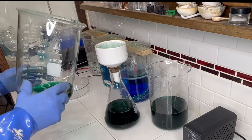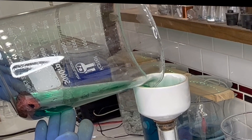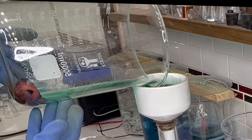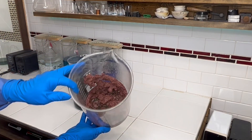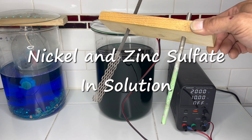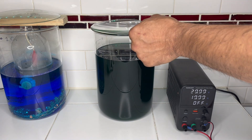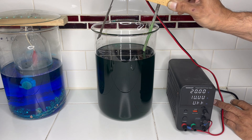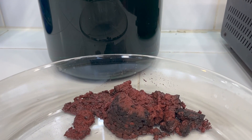I've tested this copper in the XRF and it's basically three-nines fine as long as you rinse it very well. The lowest I've seen it be is 99.5% based on what material you run in the copper cell. For this experiment we're cleaning out number two copper cell — I run a lot of different material through there, so you end up with quite a bit of nickel and zinc. Nickel and zinc want to run together, so they'll stay in solution until we can pull them apart. Once the solution is completely filtered, I place it back into a five-liter beaker with a platinum anode and a nickel cathode, run with high voltage for around three hours, and this drops all the remaining copper out of the solution leaving only nickel and zinc.